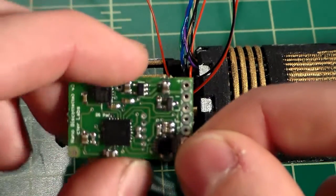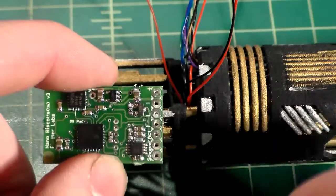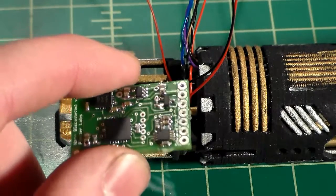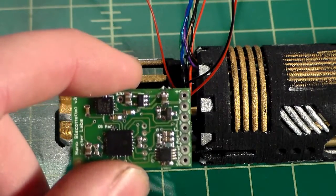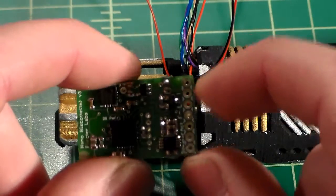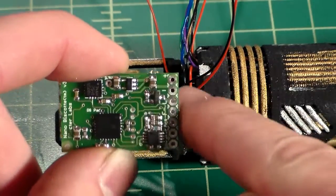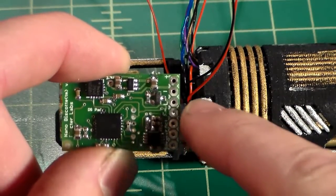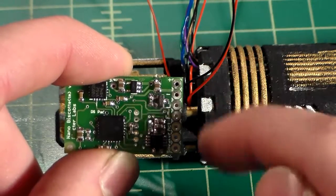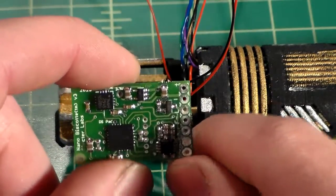What that is going to do is every time that the kill key is removed, the crystal chamber will light up. It will not have any of the blade functions, meaning there's no flicker or shimmer effect. It will be on whether the blade is on or off, and that's just the way that this one is going to be built. If you wanted it to mimic the main blade, you would take power from the main pad and connect the negative to the LED pad, in which case I would give it a green wire negative, meaning that it's going to the green pad, just to keep it straight in my mind.